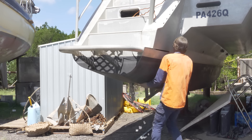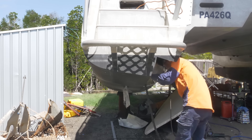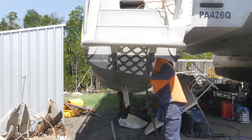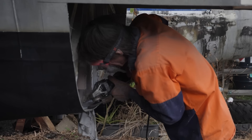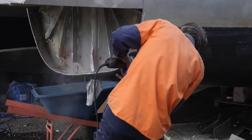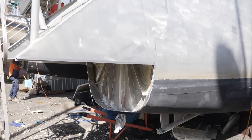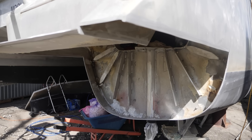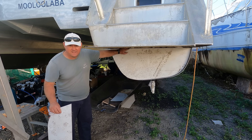The first step is to get out the grinder and cut up a perfectly good boat, which I found exhilarating and just a little bit scary. I was very impressed with how well she held together and how difficult it was to dismantle. But on to the next part, which was preparing the metal to be welded. All the old alloy needed to be polished up and all the imperfections taken out of the metal. We found we needed to soda blast all the shell plating to ensure she was fully prepared for welding. Now they're all prepared, we are ready for the next step.